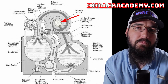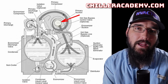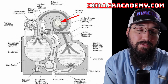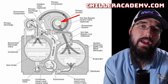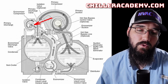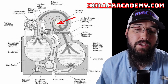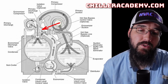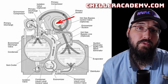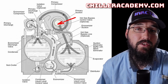If we push flash gas into the suction side, we can't maintain our set points efficiently. Because we don't have the multi-stage compressor and don't have that interstage point to send flash gas back to at medium pressure, we have to return it in a different way. York's solution was to take a second centrifugal compressor and implement it on the side where it can handle that flash gas independently. Both of these can run as just single stage high speed compressors. If we were to try to send that flash gas over to the main compressor, it would be disruptive to the overall flow of the system and would hinder our overall performance and effectiveness of the refrigerant.